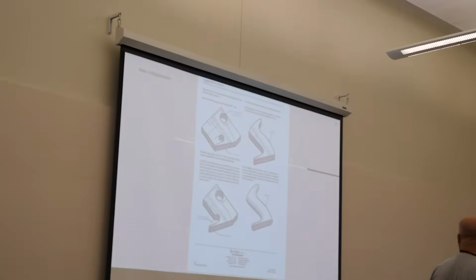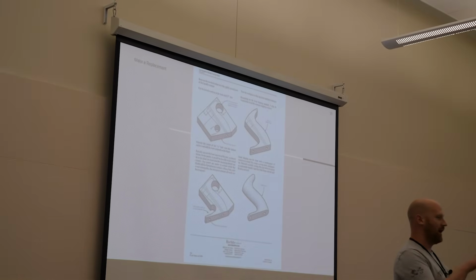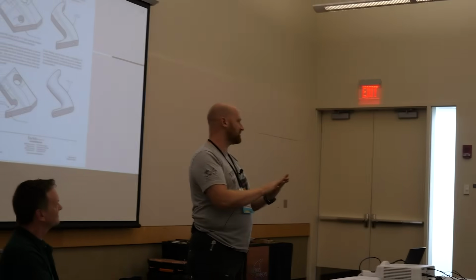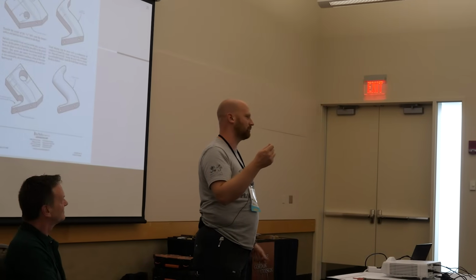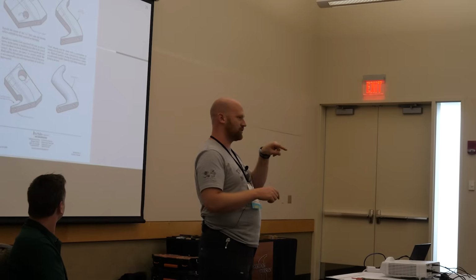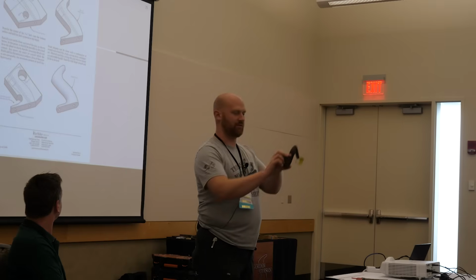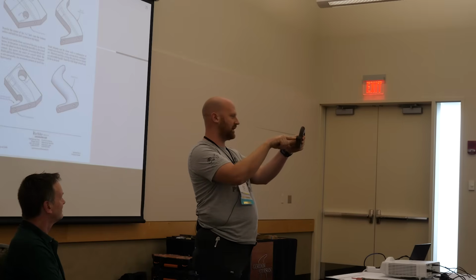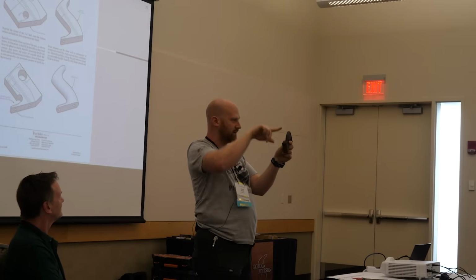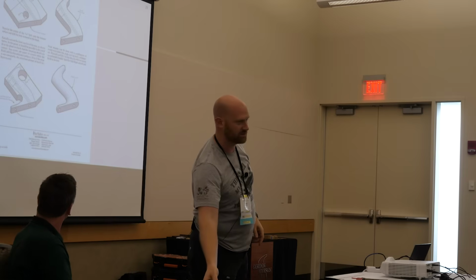Once you have the pattern on here, it's actually pretty simple. I like to take an old glue stick and glue that pattern onto the face with just your regular craft glue stick. With the pattern on there, it gives you a spot to drill 2 holes, so you have the radius for both of the inside arcs. And theoretically, those holes should be the exact curvature needed for those 2 inside marks.